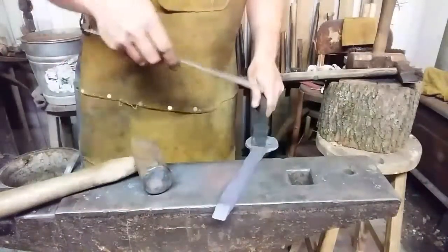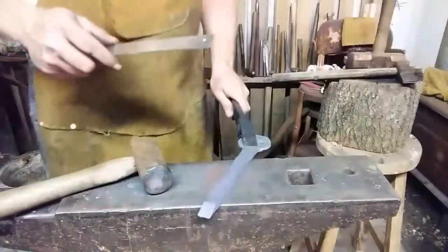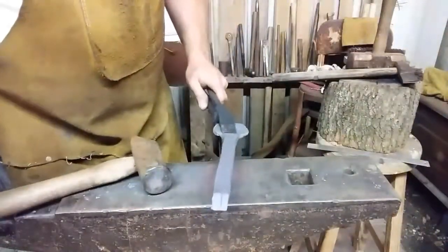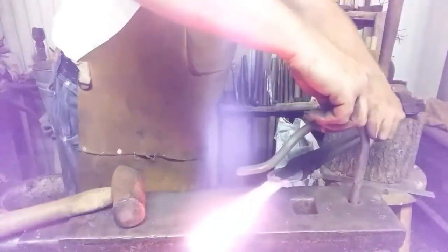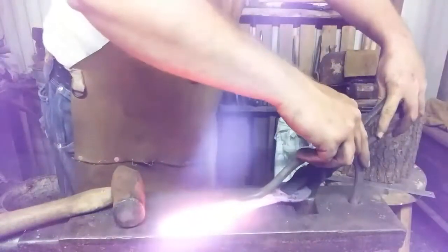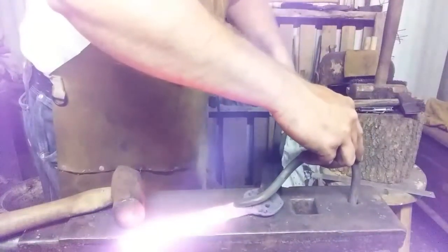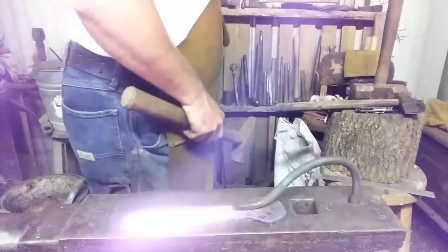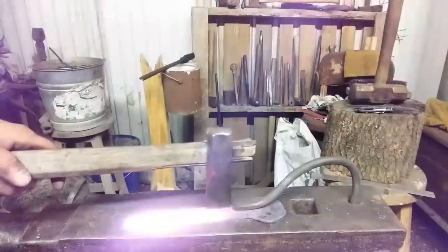Of course, the hot cut's going to displace material a little bit slanted, but it's going to be pretty good, I think. If it didn't, we'll always think it should have been. See you in a minute. Let's try to split it, or get started splitting it anyway. The more accurate you are, the less you have to fidget, the less heat you lose. That tickled. Still found my line.